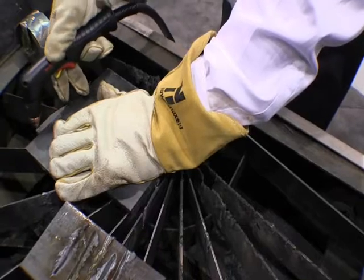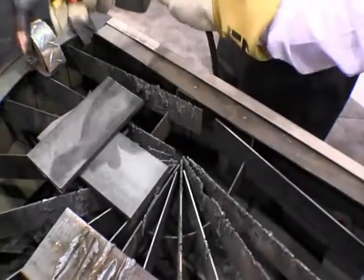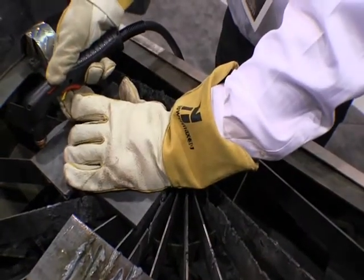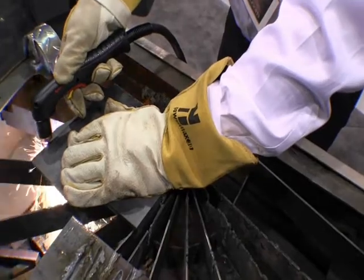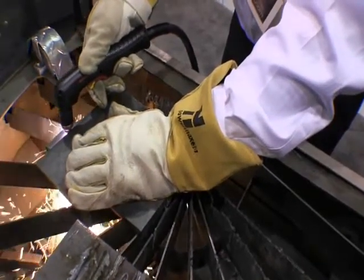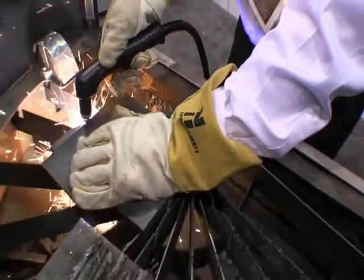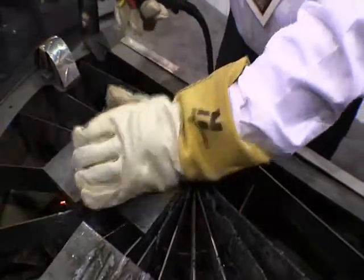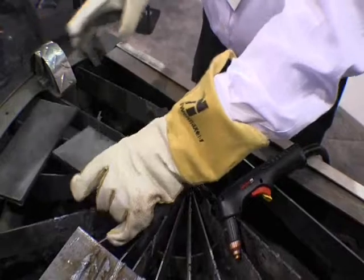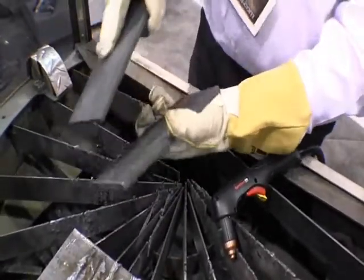What we're doing here is using a template, another piece of steel for a straight guide. Using a drag shield, I'm going to put it right down on the material, pull the trigger, and just pull right across the material. And just like that you just cut a piece of metal — anything that's left will chip right away.